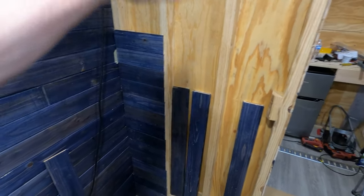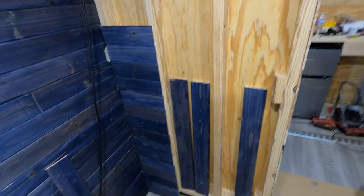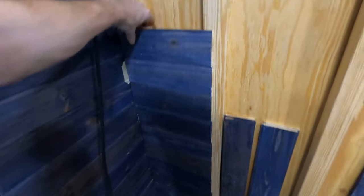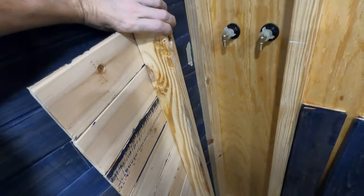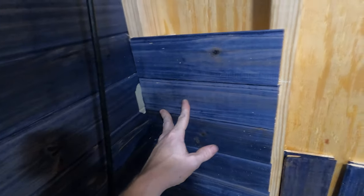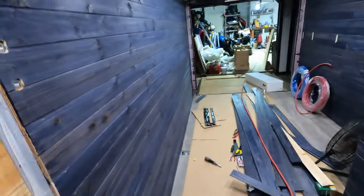What I'm going to do is fill the rest of this stationary wall. I need to put some studs in here for my TV mount. Otherwise, the panel is going up, and this section right here — if I ever need to get to the pipes — simply pulls out. There's a 2x3 here and it rests on that shelf. I'm going to go ahead and staple this in so it'll be part of the wall, but in the instance that I ever need to get back in there, I don't have to take the whole wall down.